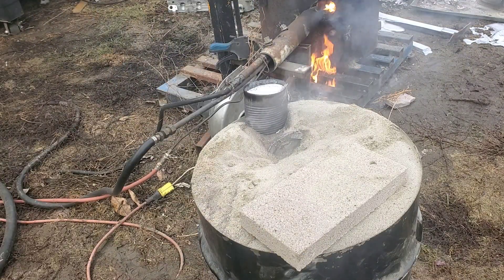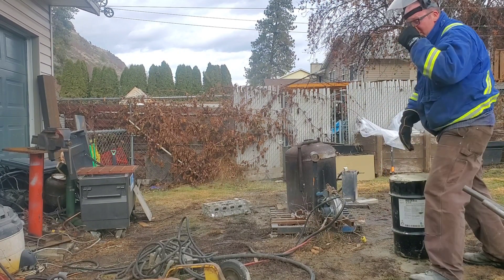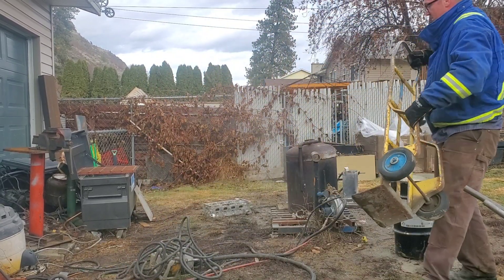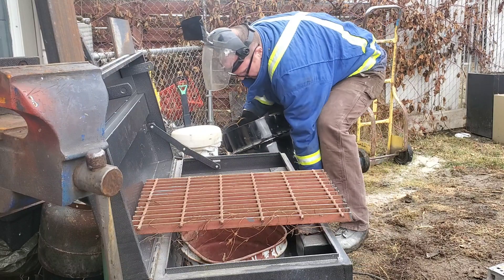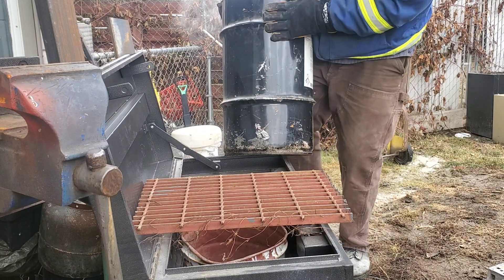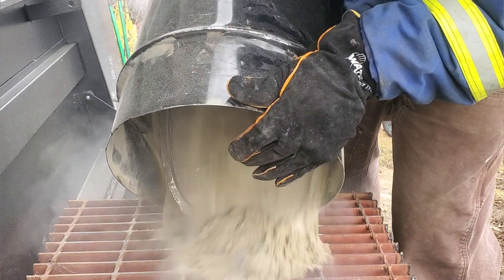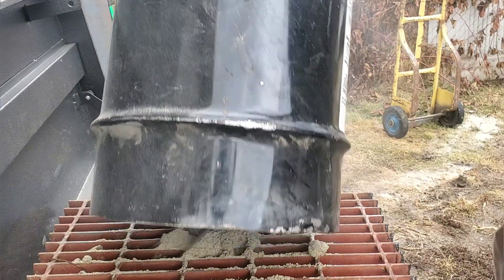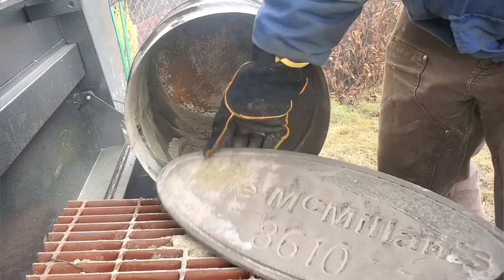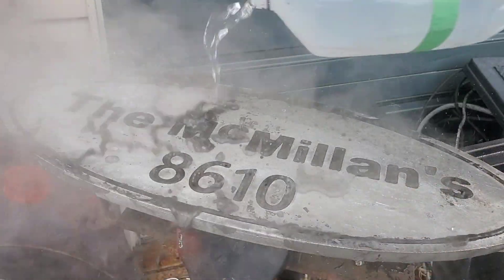I was a little worried about this one because the sprue is a bit higher than the top of the casting — I wasn't sure if the aluminum was going to flow up and around that without getting an airlock. I'm not 20 years old anymore, so I grabbed the dolly to do this the smart way. I realized I'd have to pick it up anyway to pour the sand into the small job box. Notice the screen here to catch any of the casting stuff so I don't have to dig through the sand. Before cleaning it up, let's have a look — that is pretty darn amazing. I am pretty stoked about this.